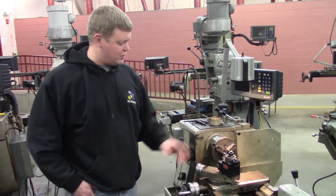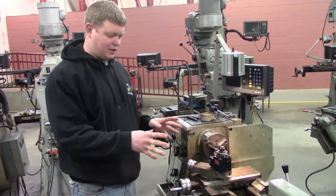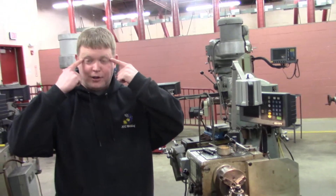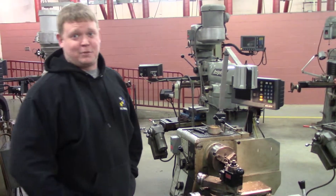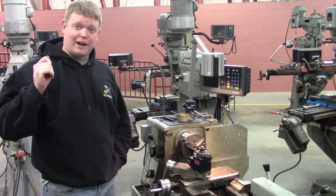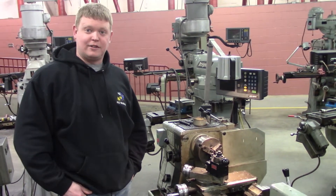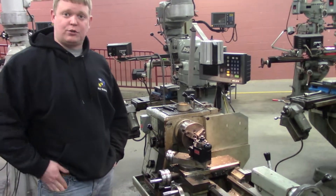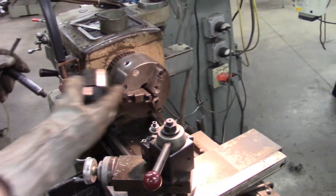When handling any of the parts, when they come out they're going to be hot, so you want to make sure you don't burn your fingers. Also, all these chips that fly all over the place are like razor blades, so you want to make sure you have safety glasses — which I don't have on right now. Because if one of those gets in your eye, somebody's going to have to remove it, and it's not a pleasant experience. You're going to have eye damage, scratch your eye, and every time you blink it feels like there's sand in it. Also, the chips can cut your bare skin like a razor blade, so you're going to bleed — you want to avoid that.